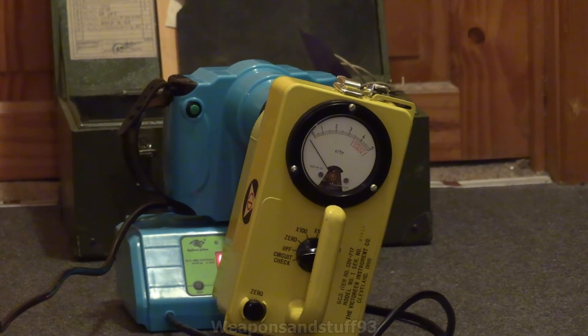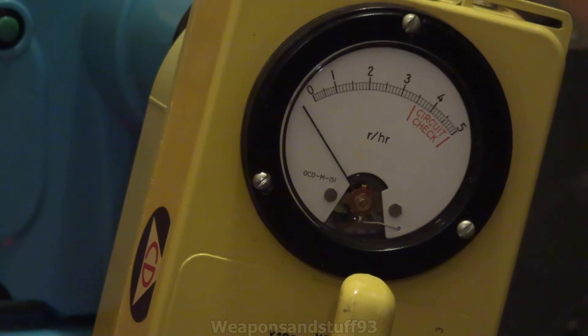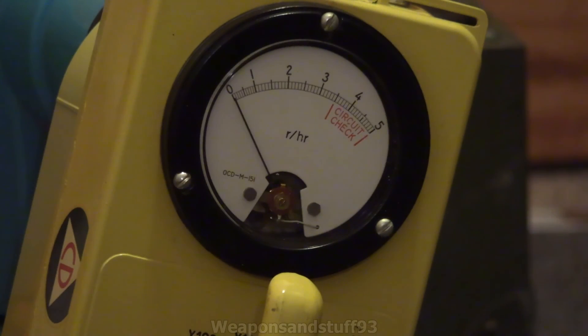Apologies, this is going to be a bit off kilter because I can't get it to work any other way. We're on the 0.1 scale. You might see the needle moving a bit — if I zero it at all it tends to go a bit over the top. The needles are moving around a bit without me touching anything. Let's use the x-ray machine. That did what I'd expect. Now it's set to the x1 scale — it's about 3.5 to 3.6 Roentgen, climbing to 4.